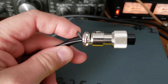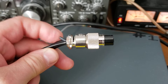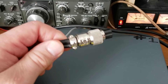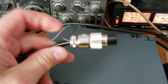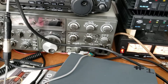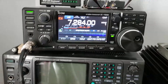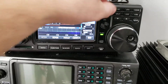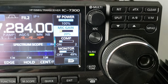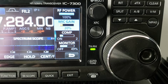What I got was just horrendous noise before I did this. I couldn't hardly run it at all — couldn't turn the mic gain up, couldn't use the processor. It just created a lot of hash and trash. So I isolated that. I've been watching lots of videos on guys using their 7300s with audio setups and they didn't seem to have a problem. But this is my setup now — it seems to run pretty comfortable at 20% mic gain and about 2% compression.